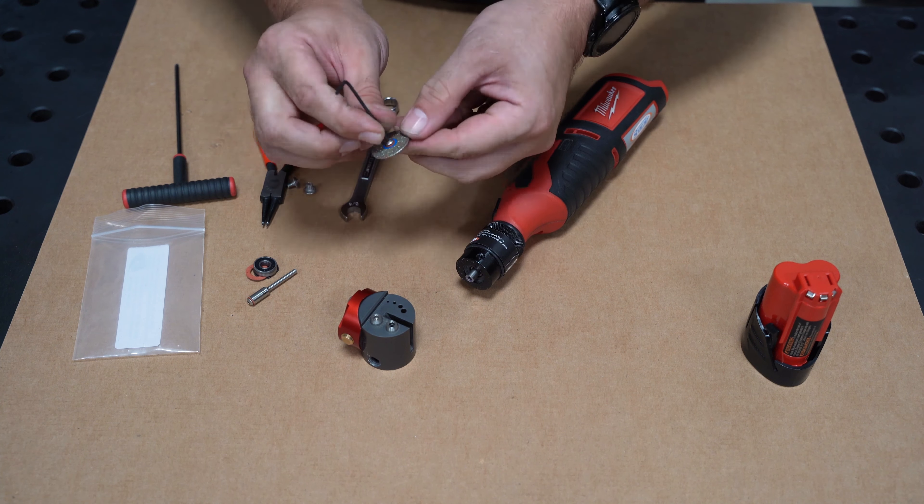Move our lower body, again back to the spindle stop, remove your mandrel. There's a tendency if you get tungsten that falls in there, this could bend, so it's a good chance to just double check it. We do supply one in our kit — we'll go ahead and replace it since we're in here.